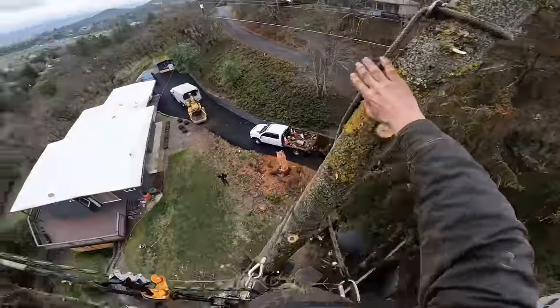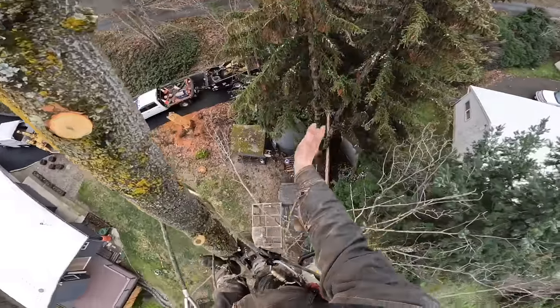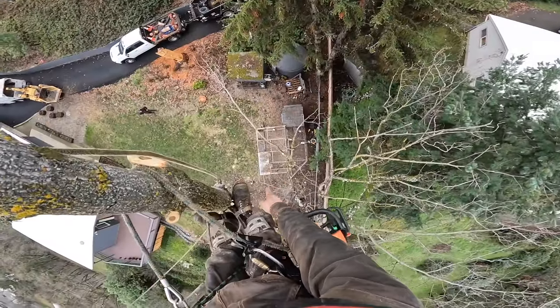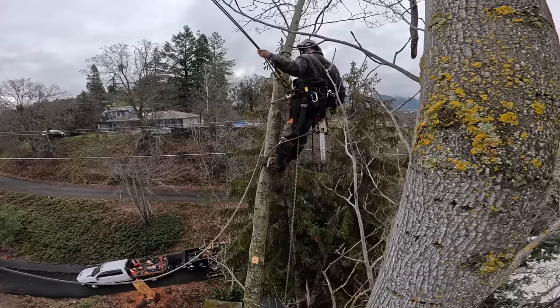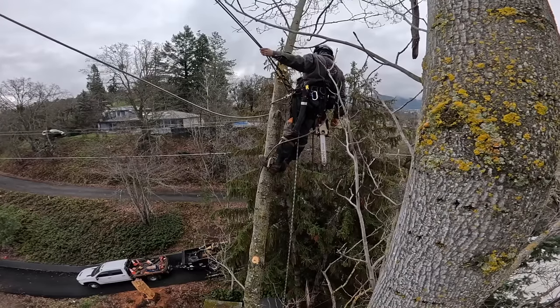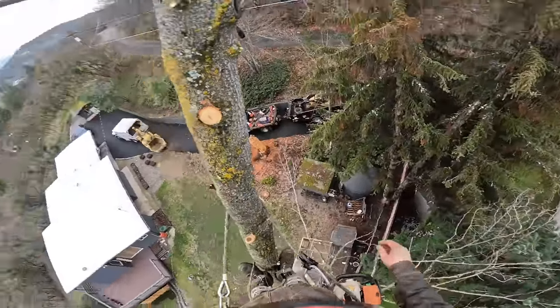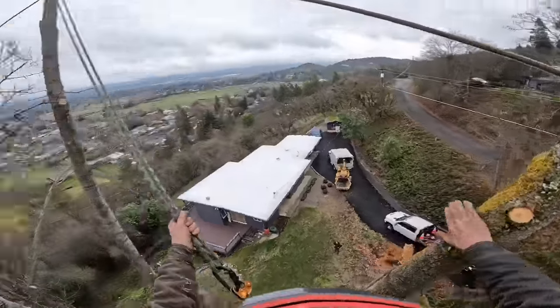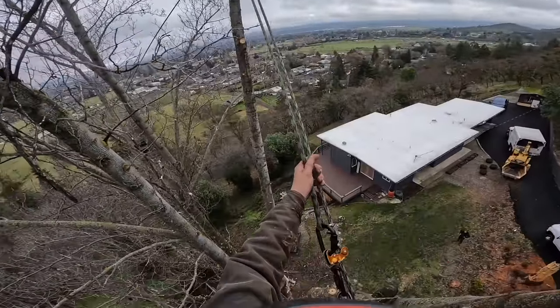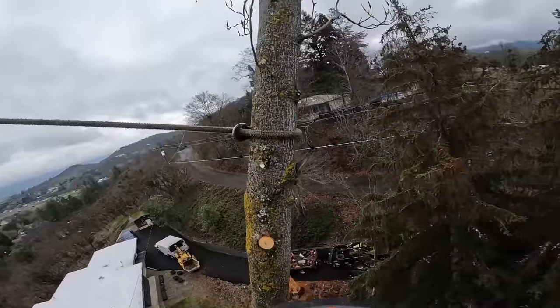Okay, this one, we're gonna try to bomb this right through there and break that one off as it goes past. It'll fling it that way. Damn, you don't have to watch for that. And there should be a pretty good wobble on my spar. You'll see, this is pretty husky, so I'm thankful right now for my backup over there because it's gonna wobble it pretty good.